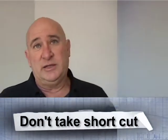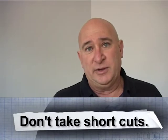the existing screed. So what happens is, if you have a glue down installation and the floor moves, you know that it's not going to pull the self-leveler away from the original screed. When we do a glue down installation later on, we're going to show you how to test the strength of the screeds, if they're strong enough for a glue down with the movement of wood. But now we're going to do the priming here, so let's start with the priming. Don't take shortcuts, because a lot of people take shortcuts and just put a screed on without a primer, and you're going to find your screed delaminating. So do it according to the manufacturer's instructions, it's very important.